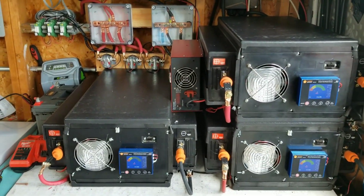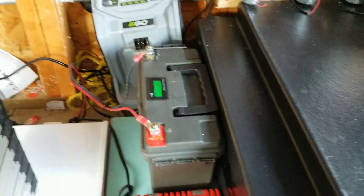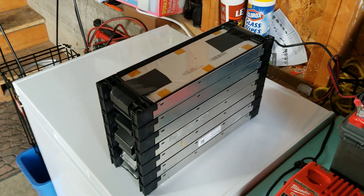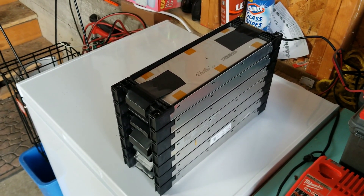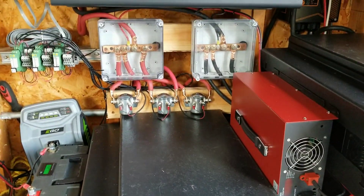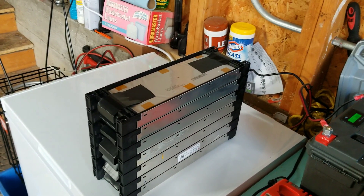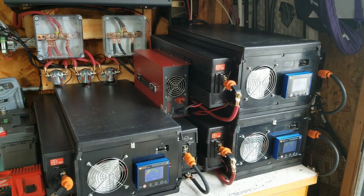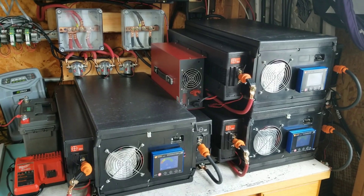This is the charger I'll use in case of power outages — I'll run a 2,000 watt inverter generator outside, hook that charger up, and the batteries will act as a big buffer. Over here you'll probably see another little project of mine: a 12 volt battery using 200 amp round cells — that was my first project. Then I got these pouch cells from Battery Hookup not too long ago. Thanks to David Poz for determining that punching holes was going to be the best approach rather than trying to solder them. It's about three kilowatts of batteries and for the weight, very nice — but these are pouch cells, you do not want to puncture them, unlike LiFePO4 which is a very stable chemistry and doesn't catch fire.